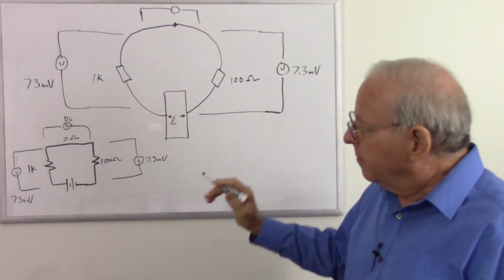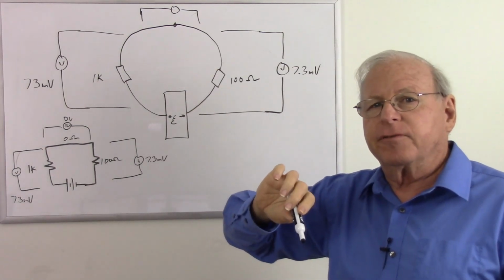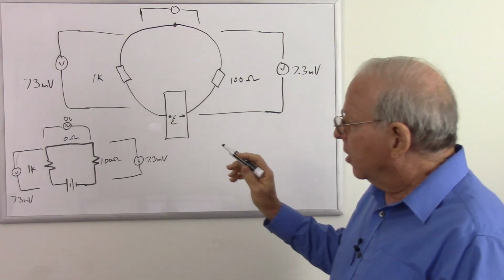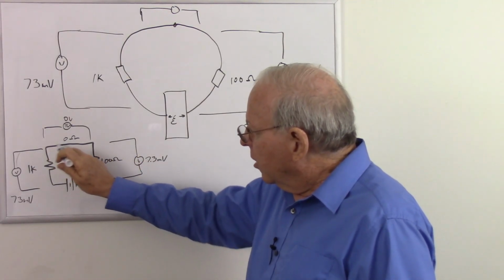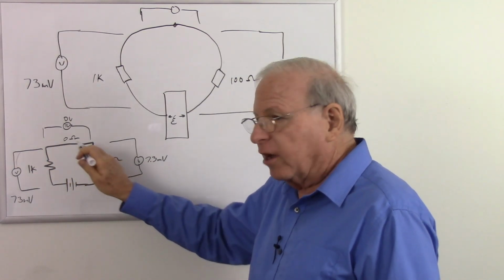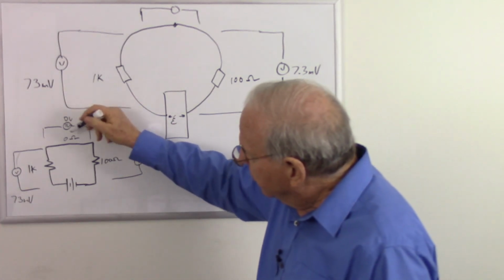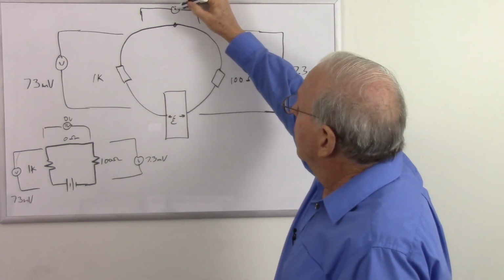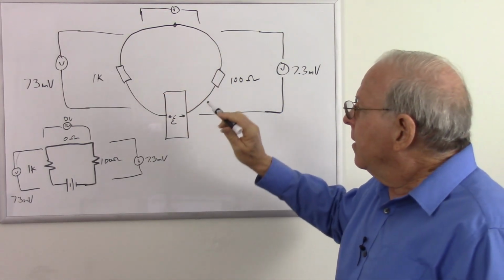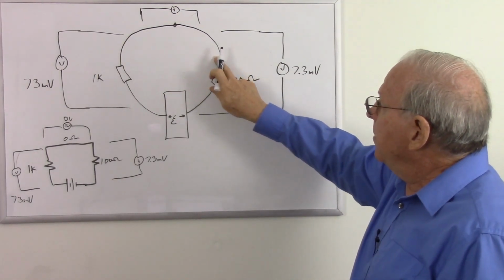Now, if we go back to the fundamentals, I've gone over this ad infinitum in my classes. You can look in the description for the classes about Kirchhoff's voltage law and series circuits and everything we can expect. We are not going to expect to see any voltage across that. We never expect to see voltage across the wires when we look at these circuits because we always assume that they're 0 ohms. So that's exactly what's to be expected. So he says that this is unexpected. Why? Because he is considering this to be part of a transformer.